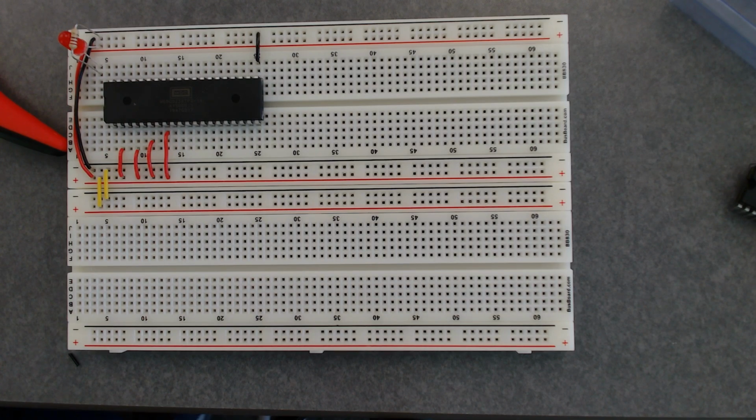Okay, now this is a little different about y'all's barrel plugs. You see how both of these wires are green? Did you look at it to say which one's plus and which one's minus and get the correct ones there? Okay, don't screw it up. In fact, I would pull those green wires and make a red and a black one. You can make those relatively short, just so that you don't get ground and plus 5 volts mixed up off your barrel thing.